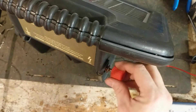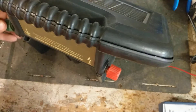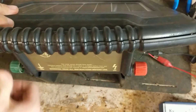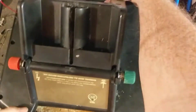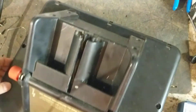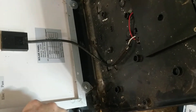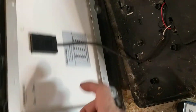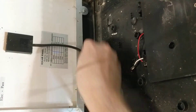That's basically how you fix one of these things. This is a Solar Guard 155 or SG155; the old model's called the PS15. Now unplug all the wires and start putting everything else back together. Shove the wires back up inside, clamp it shut. There are those two black things again - put one right there and the other one over here. Then put the bottom in first; this one has three tabs, one there, one in the middle, and one on the other side, but the one in the middle is broken.